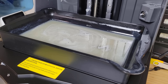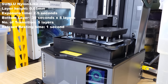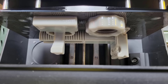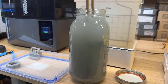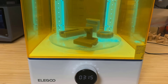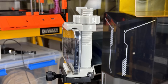Finally, I will make some functional parts with nylon-like resin. It's not nylon, but it's supposed to provide better strength and stiffness compared to regular resin. I will print a phone tripod mount, which is my new design inspired by a universal phone tripod mount. As the nylon-like resin is not water washable, I will soak it in Sunlu resin detergent for 5 minutes, and use a pair of long chopsticks to take it out from the jar. I will cure it for 6 and a half minutes. The surface is still a bit wet, and I will let it dry overnight. After about 10 hours, the surface is completely dry, and the parts fit nicely with each other. This tripod phone mount is super rigid compared with those printed by PLA.